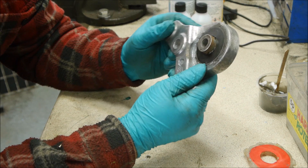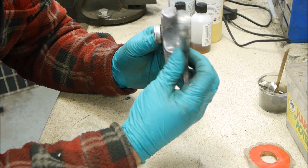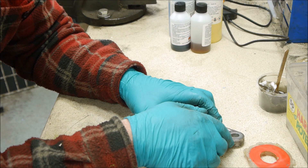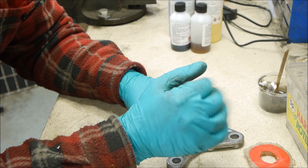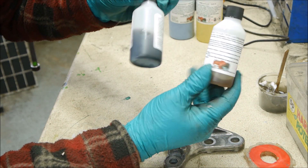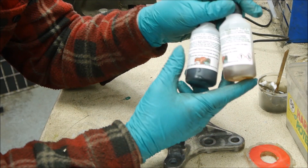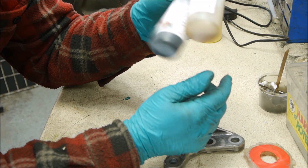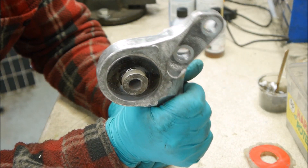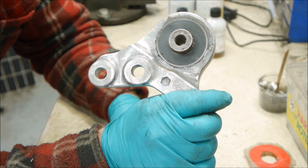It's been 24 hours now since I cast this, and I'm pleased to say it's set like rubber — unlike the first one I did. To recap: we bought Molecraft Black Polyflex 70. 70 shore is the hardness. This was 120 grams in two bottles — 60 in this and 60 in this. You mix them equally. I'll put a link in the description. This was £9.98 delivered — pretty cheap stuff. This bush from Mitsubishi was £175, so I've saved myself £165 — if it works.